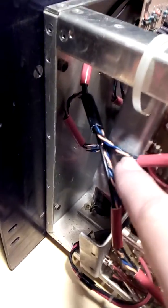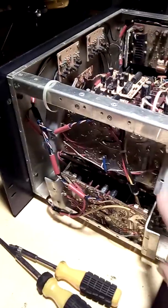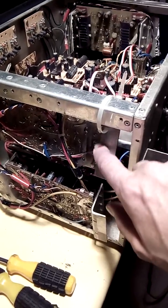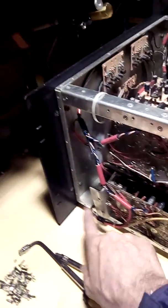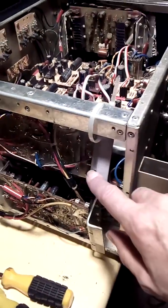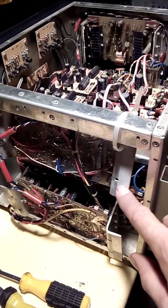I don't really know what I'm doing, but I did find that there's a pair of transistors on each corner — they all seem to check out until I get to this pair here. There seems to be maybe a short in here just from metering around. I get consistent readings on these three all the way through, negative side and positive side, but this one here seems to have maybe a short to the plate or something, so maybe these transistors are gone.